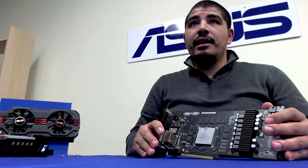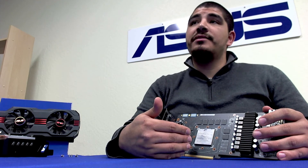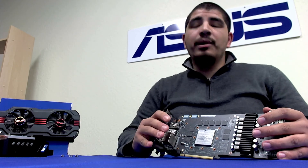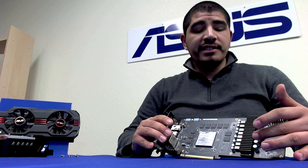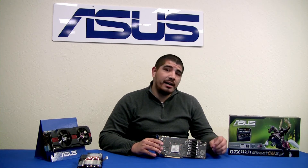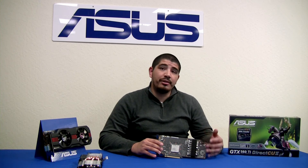In the center we have our integrated heat spreader and the actual GPU die — our GTX 560 Ti 448 — and around that we have the BGA packages for the 1.28 gigabytes of memory. ASUS has brought unique characteristics with the custom PCB design. One key element is that we've put an actual heatsink assembly directly over the MOSFETs and drivers. This minimizes overheating especially under extended gaming sessions, and since MOSFETs and drivers are generally the hottest operating parts of the card excluding the GPU, putting a VRM heatsink directly over them gives us better overclocking ability.